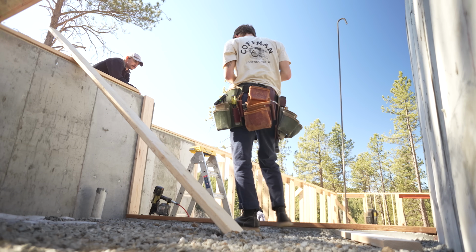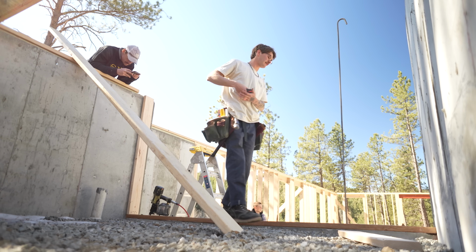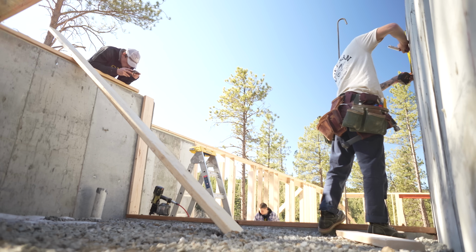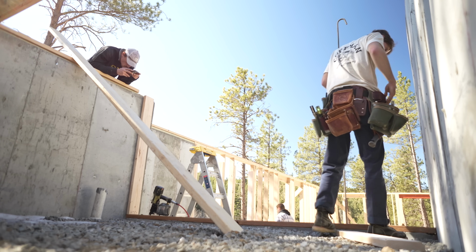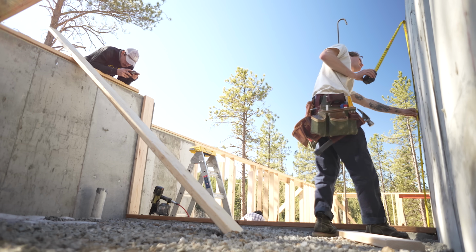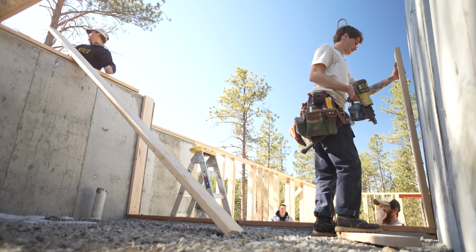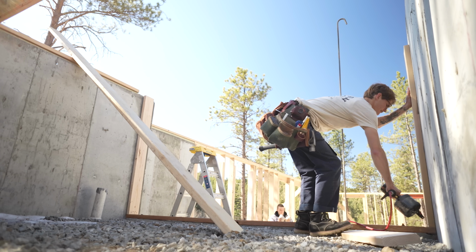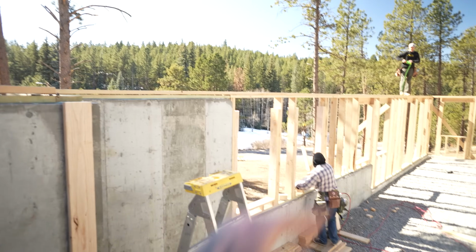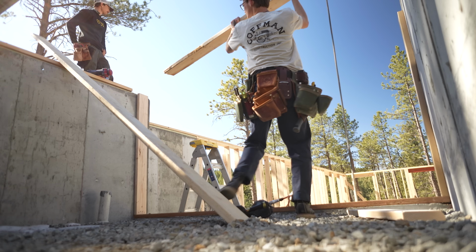All right, let's see. How big does that pack need to be? I think the beam is less than 6 inches wide, but I'll double check that. First, I will just measure this guy on his 9. It's my stud. All right, Tim, I'll take one more. 56 and an 8, barely heavy. So I've just got my 2 end studs set. I'm gonna run my plate across. I'll set a middle stud to make sure it's nice and flat. Then I can measure in the rest of these.